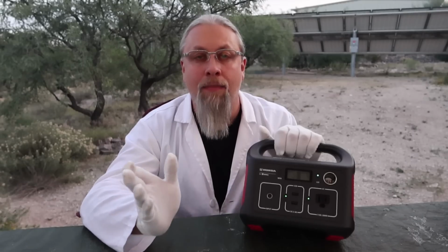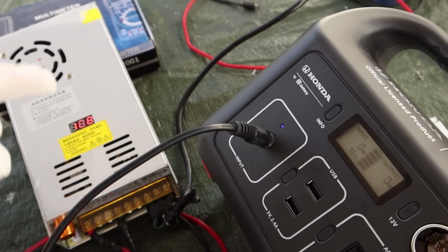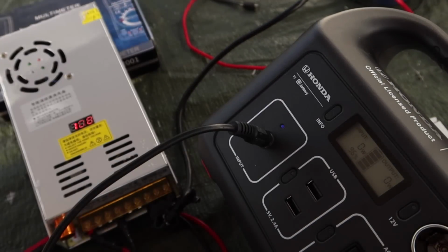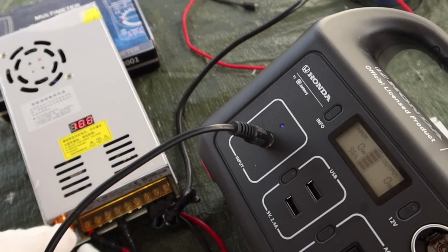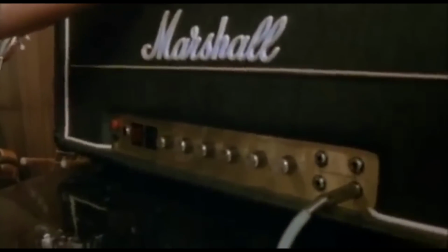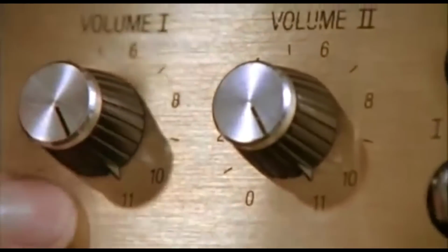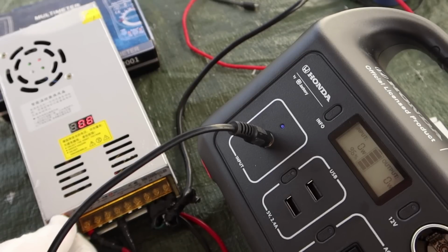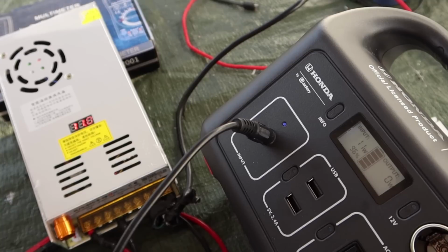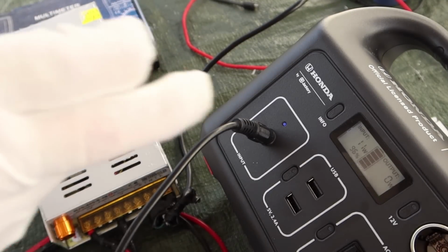And I also did a max rate charge test to see what voltages this thing could accept. Now, we currently have this sitting at 10.8 volts. As you can see on the meter, nothing. No charging at all. So let's bump it up to 11. But it's very, very special because if you can see, the numbers all go to 11. Look. We're as close to 11 as we can get. Okay, 11.0. Okay, at 11 volts, it will charge at 11 watts. So that's good to know.